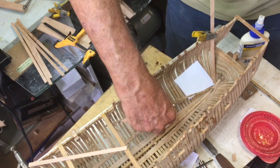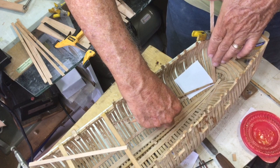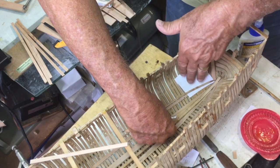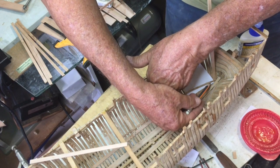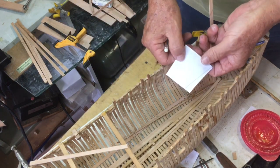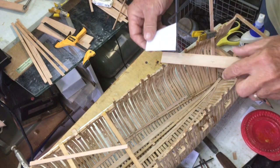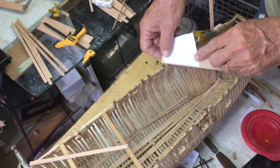To get this line here, we place a piece of paper inside. We have this jig that blocks the temporary strake that we are putting in, and we put it against the one that was there before. As you can see, that gives us a nice correct bend, and we simply draw this out on the paper stock, and that gives us the correct bend. We cut this out, and using the wide 3-inch stock, we place it in and that actually gives us the bend.